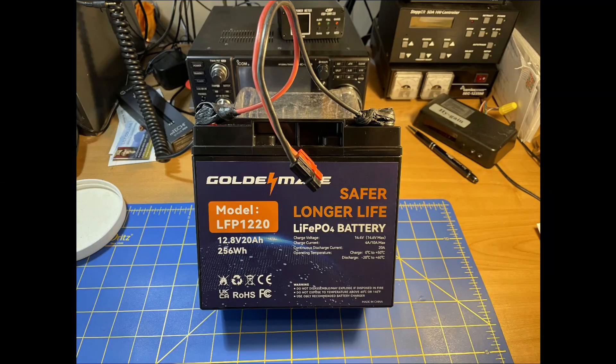This is what the battery actually looks like in my setup. I leaned it over so you could see it, and I added an Anderson PowerPole connector. I created some little terminal ends here — there are screws on these things — and I covered them with plastic self-sealing tape to reduce the chance of something getting in there and creating a short circuit.